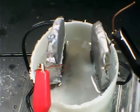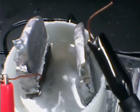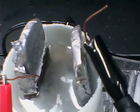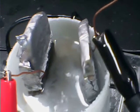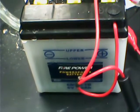After doing preliminary bench-scale work with the lead dioxide anode on the left and the lead — which will have lead sulfate (Pb2+) on it — on the right, when I find gels that I want to pursue, I'll charge them into more conventional six-volt, three-cell lead batteries that I get for about twenty dollars each, post-paid on eBay.